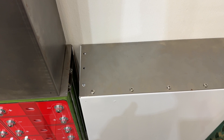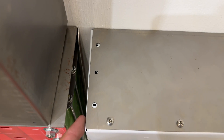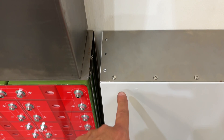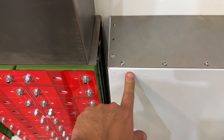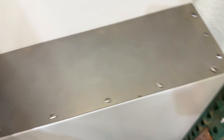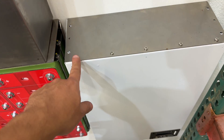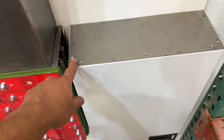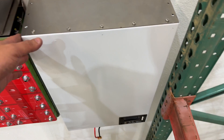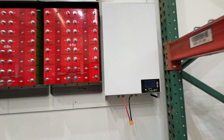Here's one tiny little thing I still have to fix — I think I just did it on the latest version I ordered. You see how it fits flush here but then it splits up in the back? That's because I made the base the same width as the front, so the thickness of the material causes it to step out like that on both sides. I couldn't make the base smaller, so I made the cover a tiny bit wider — the thickness of that material — so now it should look even. Here's the moment of truth, let's see if this will turn on.